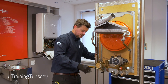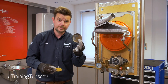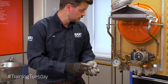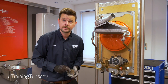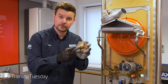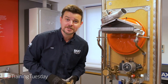Pop that front section to the side, then remove the plastic part — it's that diaphragm that you'd be getting in the service kit. Now that can sometimes stretch or it can actually tear. If it does stretch or tear, you'll have no pressure differential on either side of the diaphragm, which is why your spindle isn't coming out when you're opening up the hot tap. Once you've changed the diaphragm, don't forget to put your little nut back on the front as well. Reassemble it in reverse order, turn your cold mains back on and have yourself a nice hot bath.